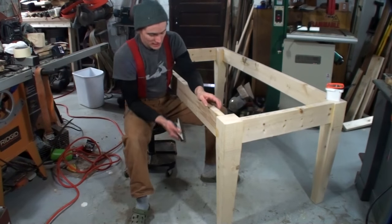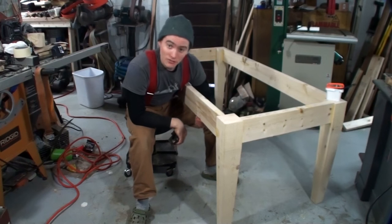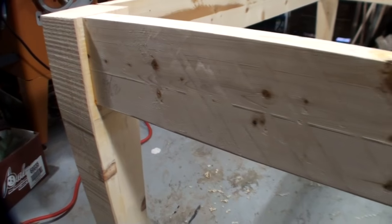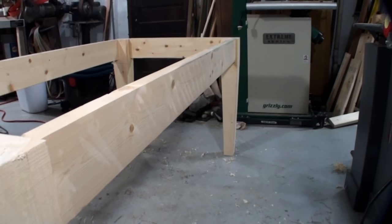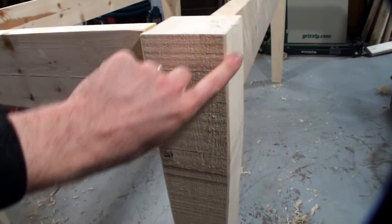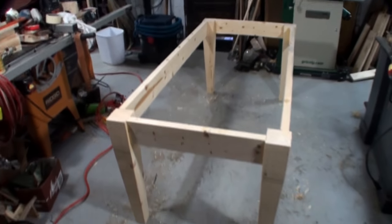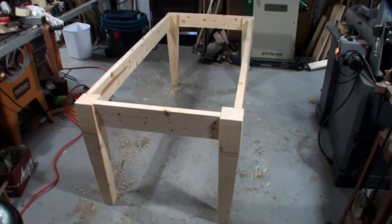The last thing I do with the hand plane is go around underneath the apron boards and knock off that sharp edge inside and out. Here's a quick detail of those planer marks in the apron boards — they go down both the ends and the sides of the table, and then of course the little small chamfers I plane onto the sides of the legs and on the underside of the apron. All that, like I said, it's just quick rough work. You don't need to be careful. Kind of the less careful you are the better it's going to look in the end.